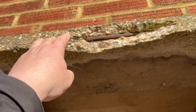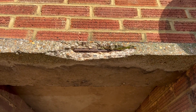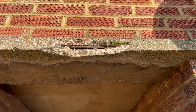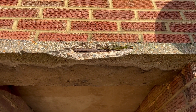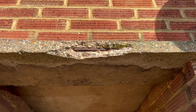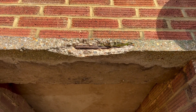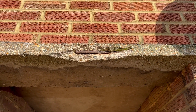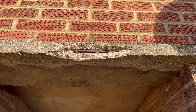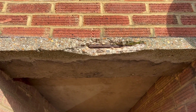But as you can see here, there are little cracks — fissures in the concrete — and water gets in and can reach the rebar. When it reaches the rebar it creates rust. Rust increases the diameter of the steel bar. So water gets into the concrete, hits the rebar, makes it rust, the rust expands the rebar a little bit, makes the crack a little bit bigger, then you get more water coming in, rusts it more, expands the rebar further, makes those cracks bigger. Eventually it's a self-fulfilling prophecy — it just keeps getting worse and worse.